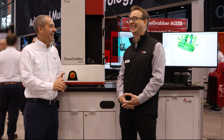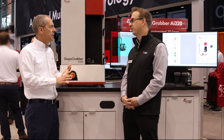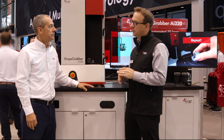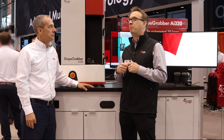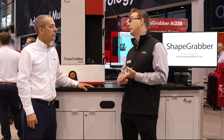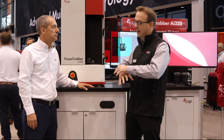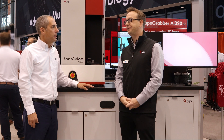Applications include plastic molded parts, castings, bone screws, hip implants, museum artifacts, and jewelry. The niche tends to be more on the inspection and quality side of things. It excels at any production method that is inherently unpredictable — injection molding, casting, forging, 3D printing — where there's shrinkage, warpage, and characteristics that are really difficult to characterize with traditional tools. With the scanner, you capture the entire surface and can see exactly how it has warped and shrunk.